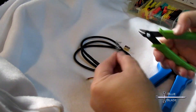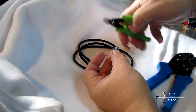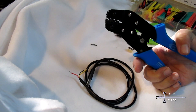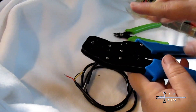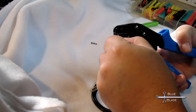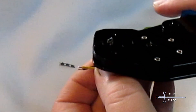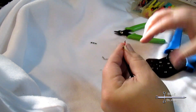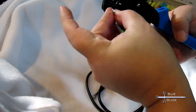The crimp pins usually come attached to a long strip when you buy them. I use my clippers to liberate three of them. Place the pin into the correct slot of the crimping tool with the spring tab extending out and pointing to the front of the jaws, then ratchet down just enough to hold it in place. Make sure the insulation is stripped off the last eighth of an inch of wire — these came pre-stripped. Then push the wire into the back of the crimp pin just until it starts to reach the spring tab. When you have the wire where it needs to be, squeeze the tool to crimp it in place. Check your pin to make sure it's firmly attached, then repeat for the remaining wires and pins.